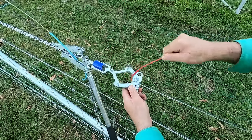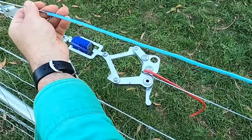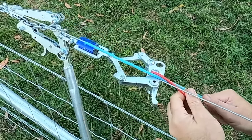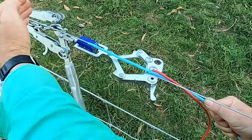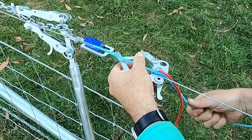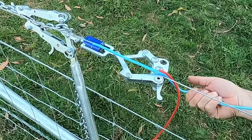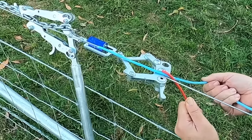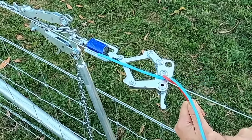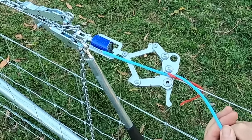The first part of tying this knot is to make a keyway in the main section of wire on the fence that you're straining — just a simple little loop. I'm then going to get the piece of wire that crosses over the top of the strainers — coloured blue — and put it through that hole I just made, pulling it nice and tight so that it's not bowed out over the strainers. Next I'm going to pull the blue wire down a little bit to make a slight twist — not a 90-degree bend, more like about 30 degrees — and then make a crank handle, bending a 90-degree handle for myself. This knot is really strong because it keeps the two loose pieces of wire together first. I'm going to gently bring the blue over the red — it's very important not to go over the tensioned wire first. The blue wire must go over the red wire first so you put the two ends over each other, because they're the ones you want to twist.